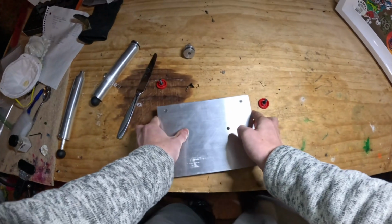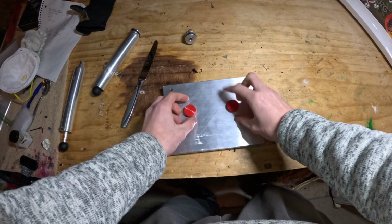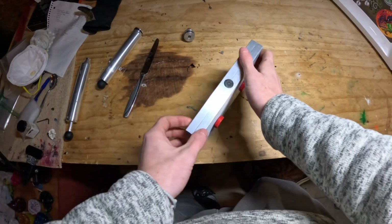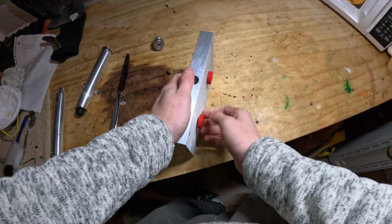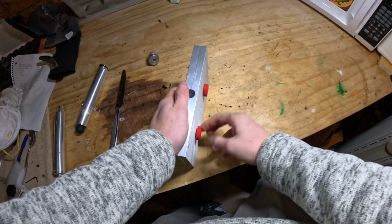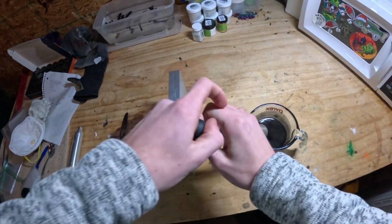One thing I do like about this mold is that it is pretty easy just to kind of clamp it down and screw these in. You do want to make sure though, because it isn't one that you use clamps with, it's one that you use screws, that you get these nice and tight. I know it doesn't look like they're fully tight, but they are. Sometimes, however, it can get stuck right here and you think it's tight, but it's not. You just want to make sure you get it all the way tight. Alright, the plastisol is back up to temperature.